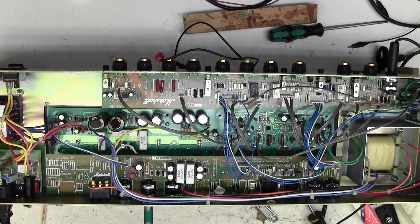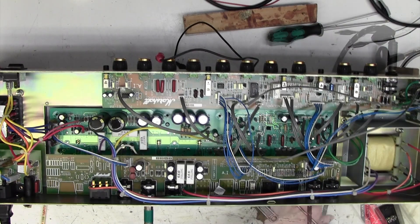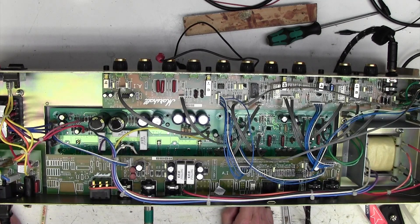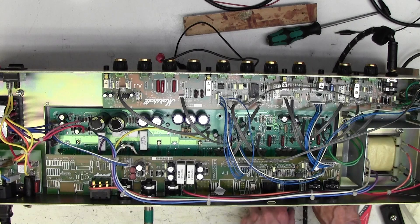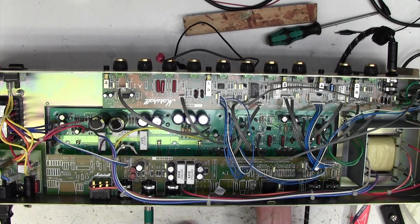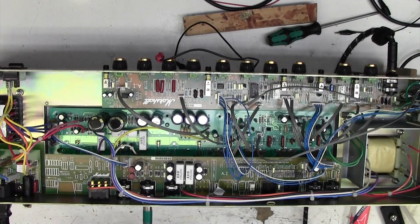That very short period of red plating won't have harmed the valves - they'll still be fine. That seems okay. I haven't fiddled with the controls very much but basically the amp is working. Hurrah! Oh yes, I'm going to give this V2 a wag - oh yes, there is a problem here. You can hear exactly what's going on. This amp is fighting all the way, isn't it. Kind of intermittent problem on that valve. How strange.